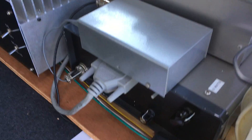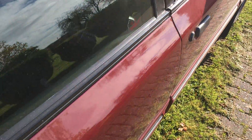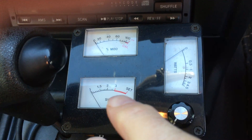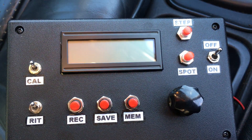The actual transceiver, which started life as a Yaesu FT-180 marine transceiver, is in there. In the cab I have a complete system where I can see the forward and reverse SWR and the power, and this is the DDS synthesizer that I built which controls the crystal controlled transceiver. So that's about the story.